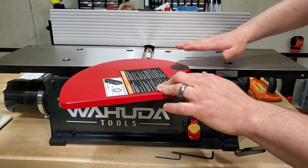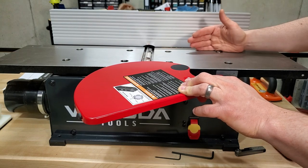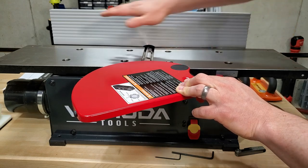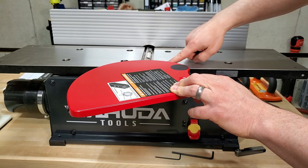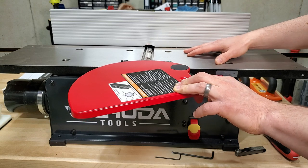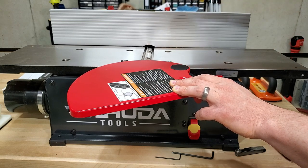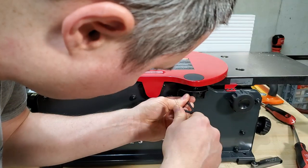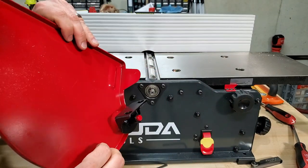The tables themselves are almost perfectly flat. On the back edge of the outfeed table and the front edge of the infeed table, there is a 1.5 thousandths dip from front to back. These are the same part number, just flipped 180 degrees — I think it's their manufacturing process, so most tables will have that same dip on one side but not the other. It didn't seem to affect my jointing, even up to a 6½-inch board. To start adjusting, take the guard off first using the larger Allen key — loosen the two screws, lift it out of the keyhole slots, and it comes off.